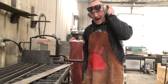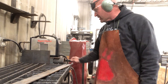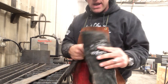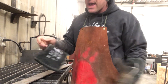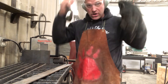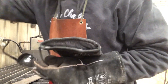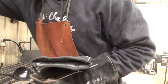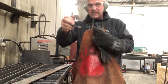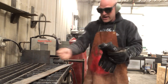This compressor is loud, so I wear my ear muffs. When you run the plasma cutter, you have to have gloves to protect your hands from all those sparks. You have to have number five shaded glasses, or you can use your welding hood turned down to number five, or you can use the Oxy goggles we have hanging here. You have to use something — you need to protect your eyes. A lot of times I'll just grab these and put them right over my safety glasses and they'll work fine for cutting.